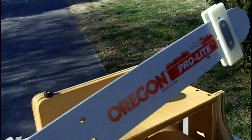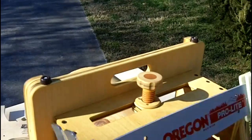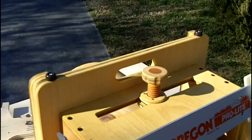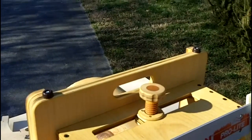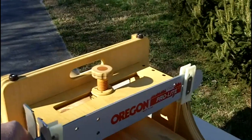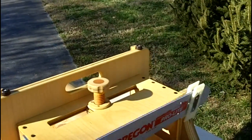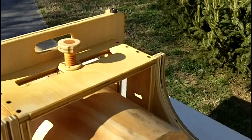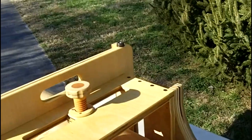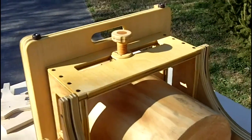Which, by the way, once it's down here, you don't cut straight down on a saddle notch. You cut and really get rid of that big piece of pie, and then you start making carving cuts, and eventually this chainsaw attachment will start riding around this pattern, and you can tilt it because of the belly of the bar. You can tilt it and actually cope out that cut all the way around so that it fits real nicely on the perimeter of your pattern, whether it be a round or a D-log or whatever it is.